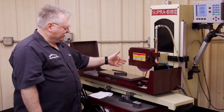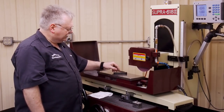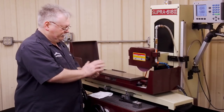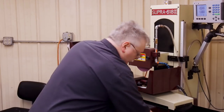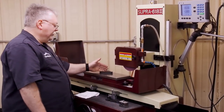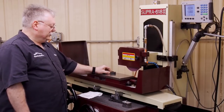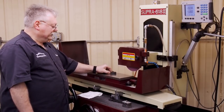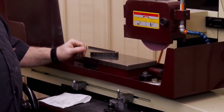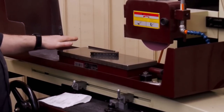Take your part — if it's bowed — and rub it on the magnet. You can feel where you're hitting on those high points. If I flip it over, I can tell there's a little bit of bow in the middle. When you're trying to get a low magnet setting, this is something that's just going to be acquired with time and experience. You want it so that I can still move the part, but it's still tight enough I think I can get away with it.